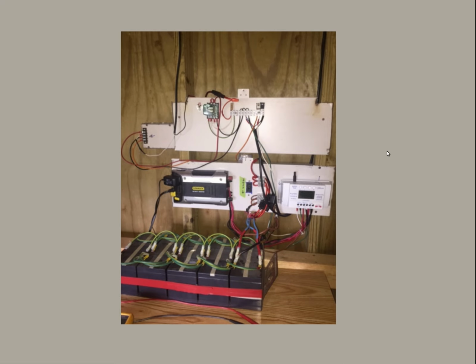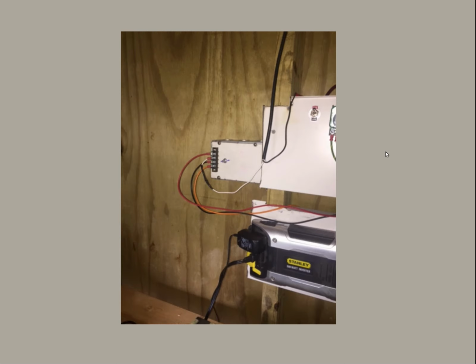So here is the circuitry in question. They're on a breadboard right now. I'm waiting on a Hoffman box to get it painted to put all this in. But as you can see, it's all laid out there on breadboards. Here you've got your voltage regulator and your inverter. Here is the wind shutoff and the wind overprotection relay. The 1.8K resistor for that overvoltage relay, all they had at All Electronics was a 5-watt. I think that's probably overkill, but it's what they had.